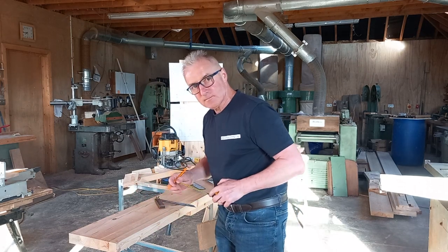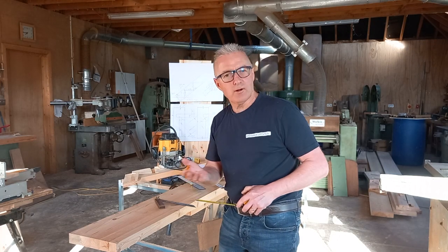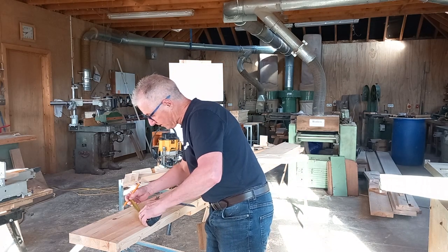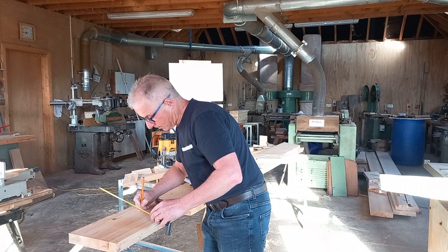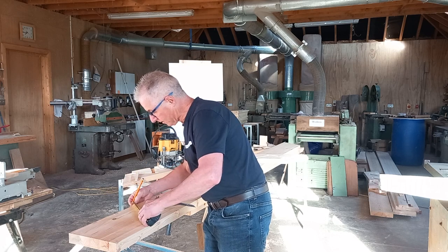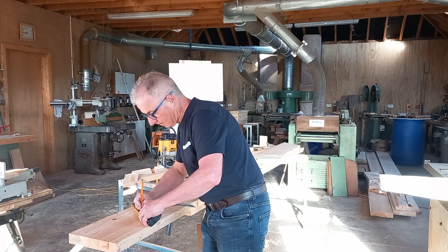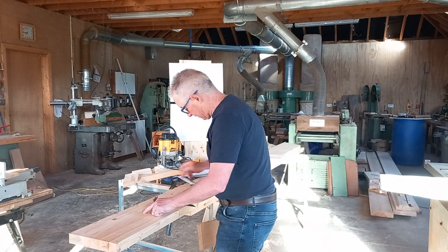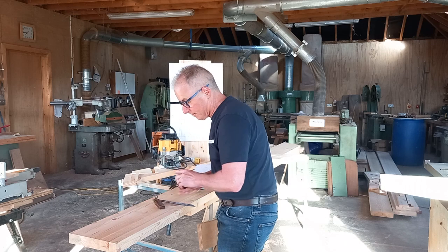And on that line, you measure the height of the skirting board, which is normally around 5 3/4 inches, or 146.7 in millimeters. I'm just going to use old money here and come down there 5 3/4 inches. So it's a 6-inch stock. If you're metric, I forgot to allow for the inch there, so I measure 6 3/4 there, which is actually 5 3/4. I start from the inch mark just for accuracy. Start from the inch point and I measure down. It's just a habit I have.